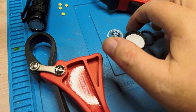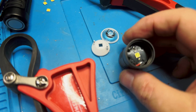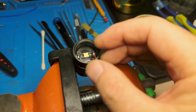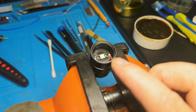The optic and an O-ring came out. There's a little white reflector — tap tap tap — that pops out, and now we've got the MCPCB. I'm going to unsolder the two leads with my soldering station, pull the MCPCB out, and stick it on the hot plate.